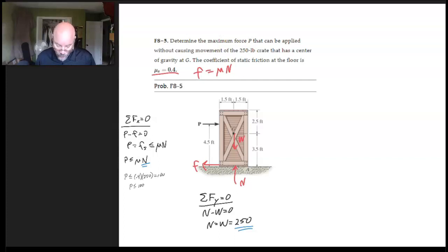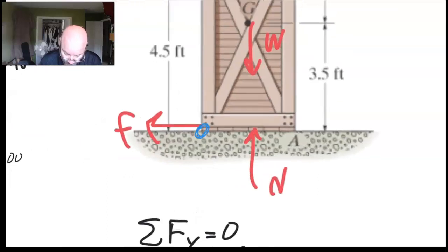So what we'll do is zoom up a little bit here. We're going to put a pivot here, and let's call this x. We're going to act like the normal force is concentrated in some particular location. Now, the reality is that our normal force is going to have some kind of distribution, and if we knew that distribution, then we could find where that force is concentrated. What we're doing is kind of backwards. Instead of finding where a distributed load is concentrated, we're going to find the point of concentration and not know what the distribution actually is.